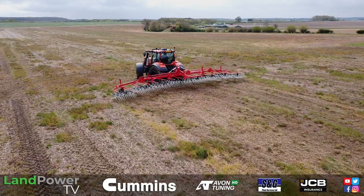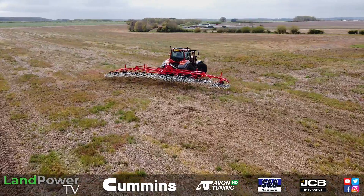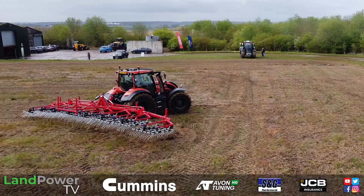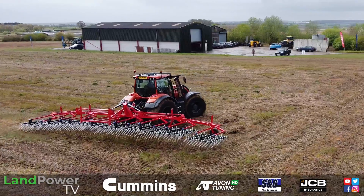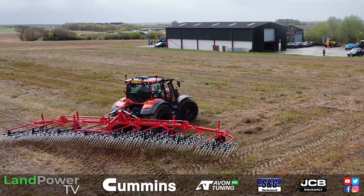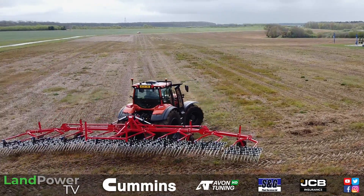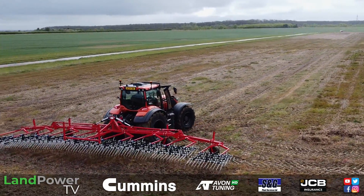So we've got Smart Turn, which effectively turns the tractor on the headland for you, whether that's in a loop or skip loop, which we call park field mode. It'll also do Y and K turns. So if you imagine you've got a linkage implement such as a harrow, where you want to pull out onto the headland, back up and come back on yourself — a plough, for example — it'll do that as well. So you can sit there and it will just basically turn on the headland for you.